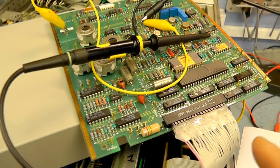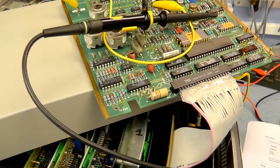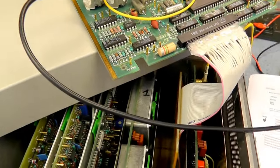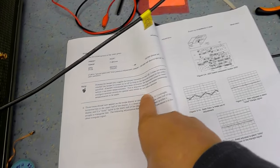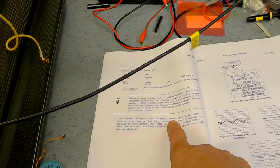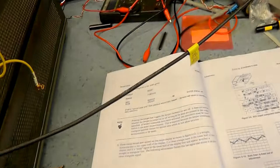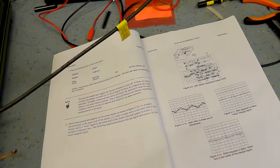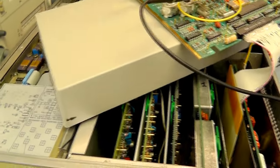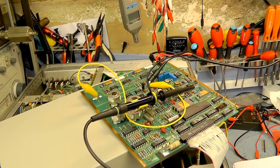It's important to really read the kit very carefully — when it says setting up about the scopes, don't think you know what to do. I missed things like: it says you've got to have DC coupling on. You could forget that and be thinking why can't I get this in the right position, then realise you're AC coupled — it just doesn't shift position. So this point seems to be going fairly well. I'm going to finish off this adjustment and then just run the self-cal on it again and see what it comes up with.